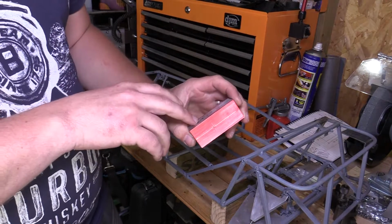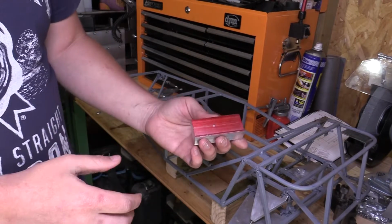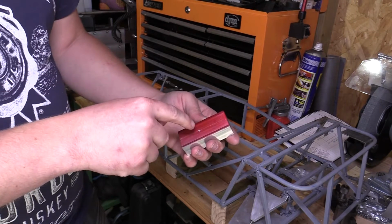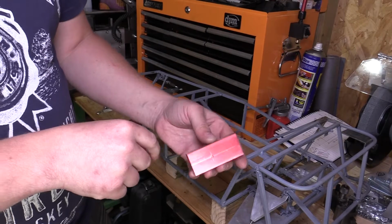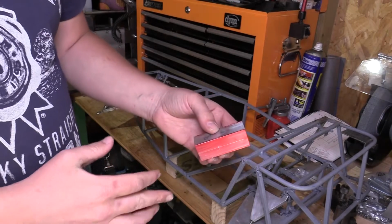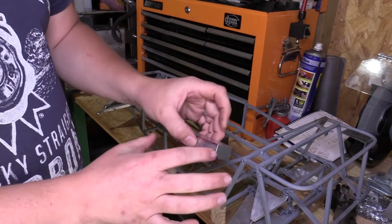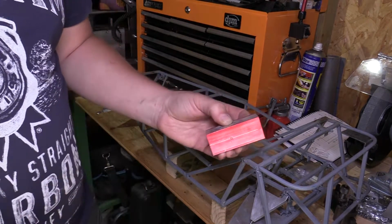So as I say, this aluminium stock has now been squared up. It's to the overall dimensions, so there's some details to machine out. But the first thing I'm going to do is drill the holes in the front face and in the side while I've got it square and it's easy to reference the position of those holes, because once we start machining the details there's going to be angles to machine on the front and the back, and we'll likely lose our reference points.